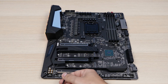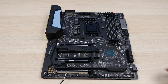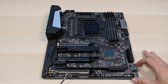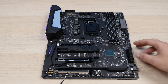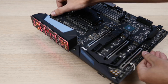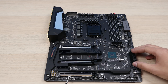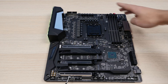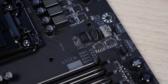You'll see I have this little cable plugged in just at the bottom here and that extends just to a standard USB power bank. It's a pretty nifty connector that Gigabyte has on board most of their motherboards that feature RGB lighting — it's just a way to basically light it all up without actually having to power on the motherboard, so it's definitely a cool feature especially for filming videos like this. The motherboard doesn't have too many RGB LEDs directly on it; it's only the ESS Sabre Hi-Fi logo that lights up, and also the integrated IO on the back. All the other RGB features will be found on the mono block — make sure you plug in the two cables for those, one labeled LED CPU around the CPU socket and the other labeled LED PCH next to the PCH.